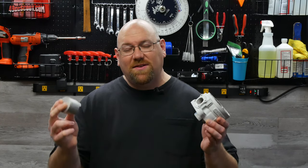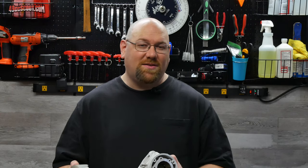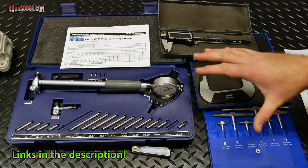Next up, I'm going to be measuring the cylinder and the piston. This isn't something that a lot of people do when they put together a small engine, but it's not a bad idea. With my last engine, when I was trying to check it for wear, I really wished I had the initial specs to compare. So in this case I'm going to go ahead and take those measurements myself, even though Molossi does provide a piston-to-cylinder clearance spec. You're going to need some tools for these measurements.